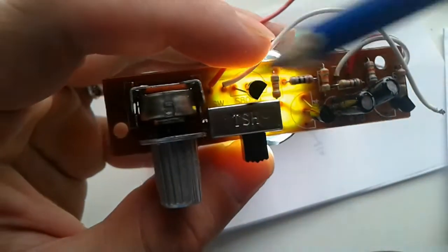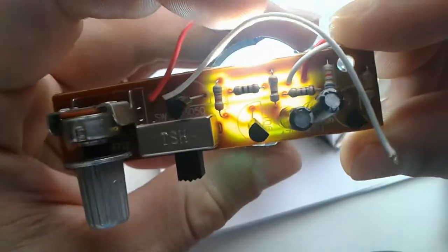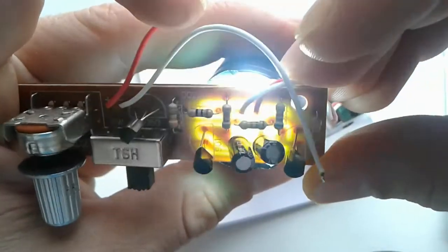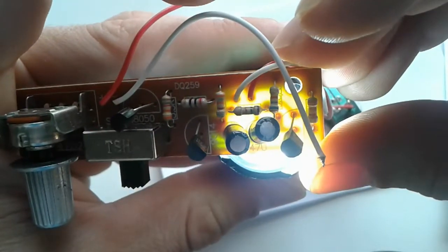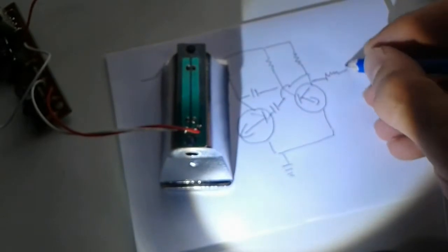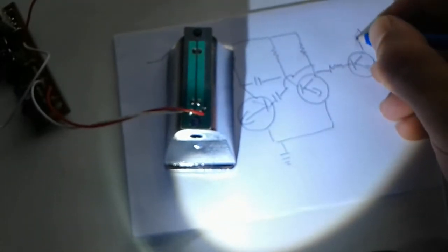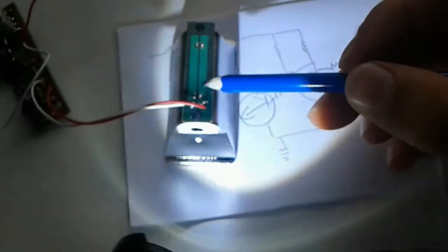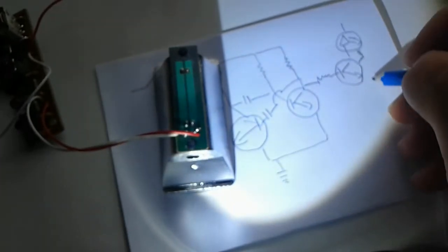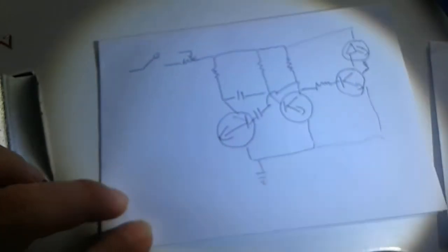As you're gonna see, this transistor connects here to the minus, then it's gonna follow this resistor, then it's gonna go to the output, and then through another resistor. Yeah, maybe this is what we can see, this is it. So it's gonna be another transistor, which I'm guessing is the same type, NPN, and those LEDs, which are in parallel as well. And then connected in between is gonna be a resistor. This one goes to ground as well, and this is it. Yeah, so roughly this is the schematic, friends.